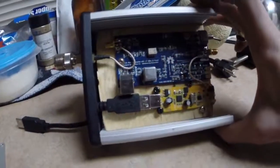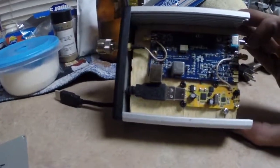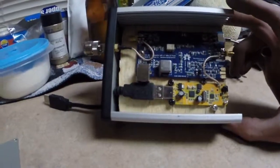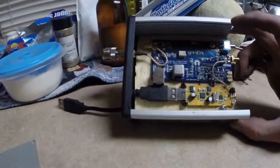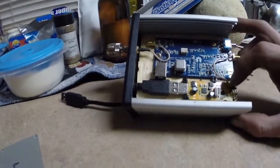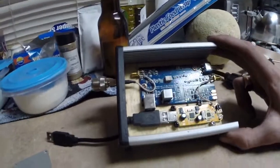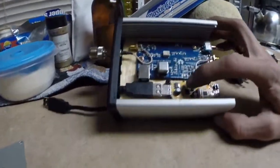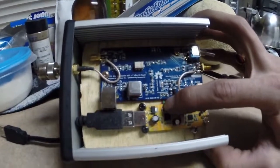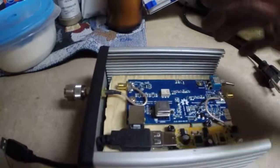I've got a 125 megahertz crystal. Usually I have the switch set to up convert unless I want to go browse some VHF or something like that. Output of the Ham It Up comes into the input to the SDR, and that's really about all that's in there right now. Power is branched out with the red and the green, so power is soldered to here up to the connector back here.